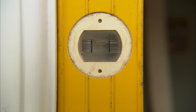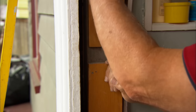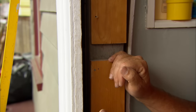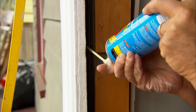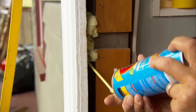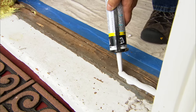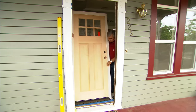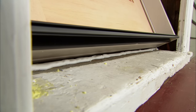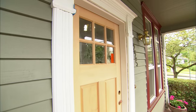Next I want to check the side casing — and that is plumb. Now, before I hang the door, there's one more thing: right here there's a big void that can let in a lot of cold air, so I want to insulate that first. We're using minimally expanding foam designed for windows and doors. Then I put a nice thick bead of caulking on top of the old threshold, so when we tilt the door into it, it'll make a nice air seal and won't let any water blow in.